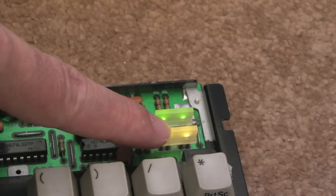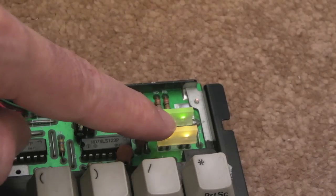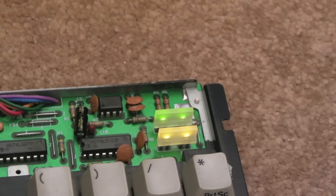So the LED is now on — if I press Ctrl-Amiga-Amiga and hold it down, it goes off. That's one use for that LED. But the way I originally planned it — I'd actually need to invert the logic. If I wanted to have it the other way — LED on normally, off during reset — I'd have to add something like a NOT gate, because with Ctrl-Amiga-Amiga it's only connecting to one place and as soon as you remove that transistor, you're stuck with whatever the inverse output is.